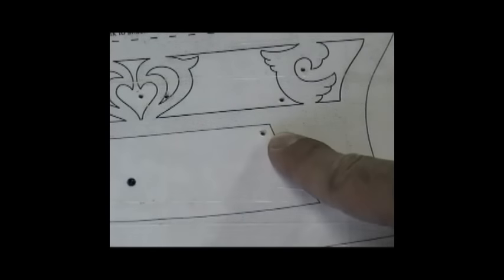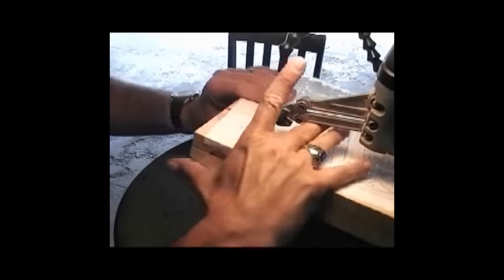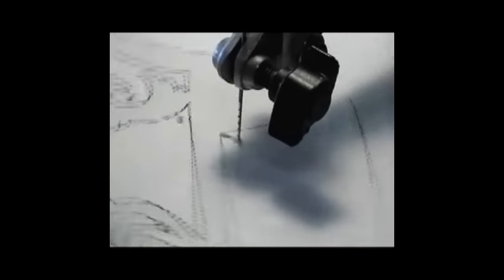On the first cut, you'll notice that I placed the hole near an almost 90 degree angle. There are two ways to cut a 90 degree angle. In this case, since I'm stack cutting and I don't want to bevel this cut, I'll make a relief cut by easing the blade to the corner, allowing the blade to eat away at the wood, up to the line and creating a space on the line equal to the blade width.